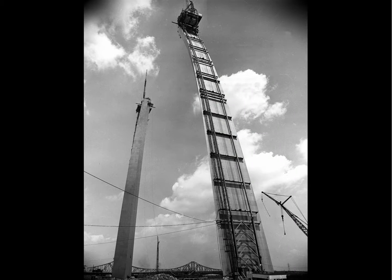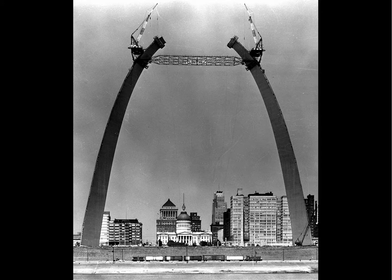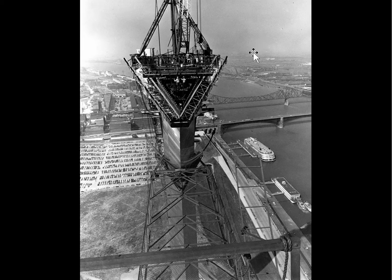There is a sequence of images showing the arch going up, with construction equipment riding rails on the outside. At the point where both halves are cantilevered out of the ground, the tendency for them to fall in towards each other becomes too extreme, so they are separated by a truss work strut that holds them apart. Construction continues up; the cross section narrows near the top but remains ample for human beings. The truss strut is a temporary feature.